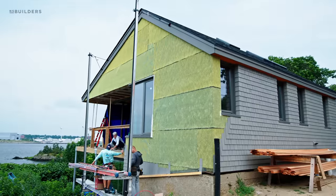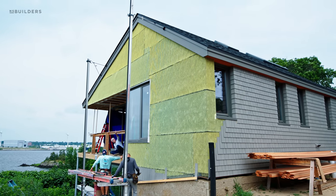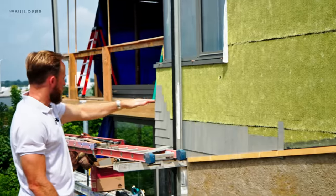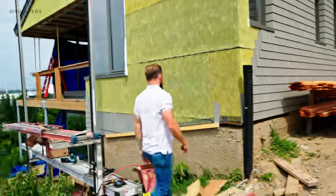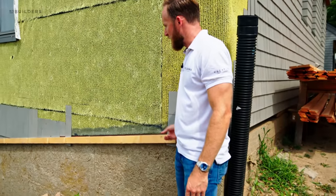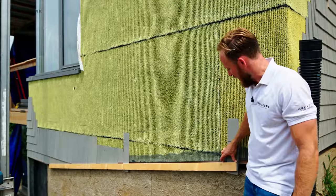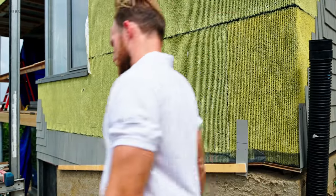As we walk around, you can see how they're getting prepped for another wall — one of the last walls with shingle. One detail Julia focused on: the shingle coursing here is roughly three or four courses lower than there, and rather than dropping straight down, we've actually ramped it down. You can see how they're prepping — they take that first shingle, drop a handful of them down, and then attach a piece of strapping they run through a table saw so it's nice and straight. Then they cut all the shingles on the same angle, and each course dies in at a separate point.